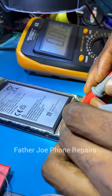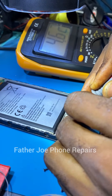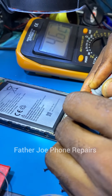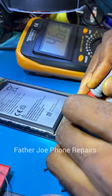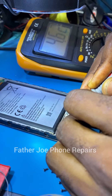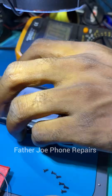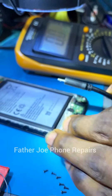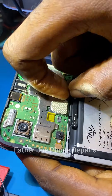The first thing I check is the charging port voltage — the output voltage from the charging port. Right here you can see we have 4.6 volts. My expectation is supposed to be 4.8, 4.9, or 5.0 volts. On the multimeter screen you can see 4.6 volts, meaning something is wrong. This 4.6 voltage will not be able to properly charge the battery.